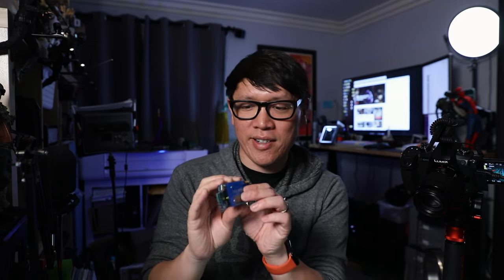But you have to plug that into the wall. Something our very own Jeremy Williams suggested to me was a USB-powered power supply, and this is one of my favorite new things. Basically it takes the 5-volt output of any USB port and ramps that up to 30 volts or down to 0.5 volts at up to 2 amps of current — so you can get about 15 watts of total power, more than enough to run these LED strips. It's especially useful when experimenting with different lengths or numbers of strands in series, allowing you to quickly and finely adjust voltage between, say, 9 and 12 volts.